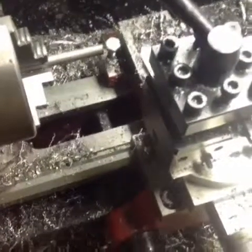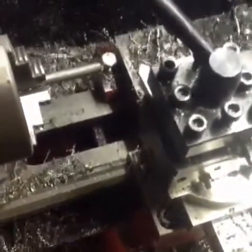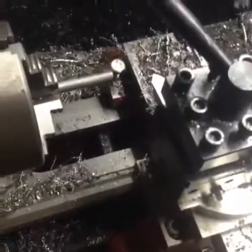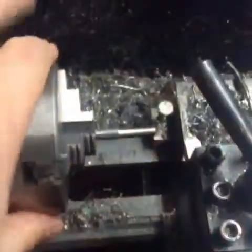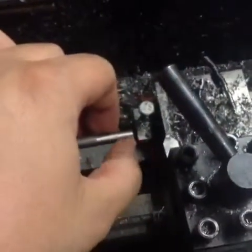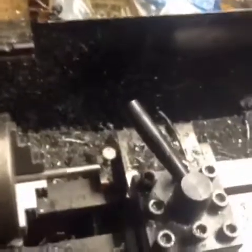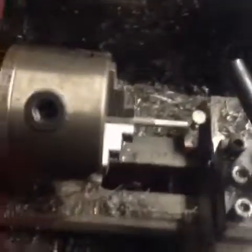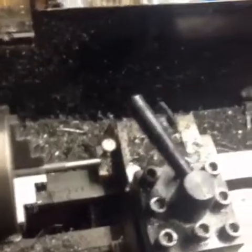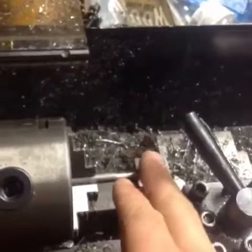What I'm going to do is touch it up, divide the number, bump it up, and check it with the calipers. It's very time consuming until you get it right, then all you've got to do is profile the bullet - it's really not that difficult. That only took about two cuts. It's got a little bit of a grain to it because I was doing it fast, so I'm going to take a file, turn it on, and knock the edges down a little bit and make it nice and smooth.